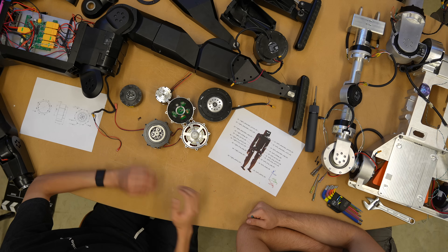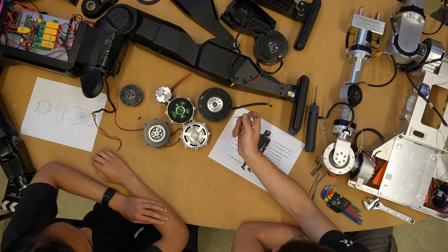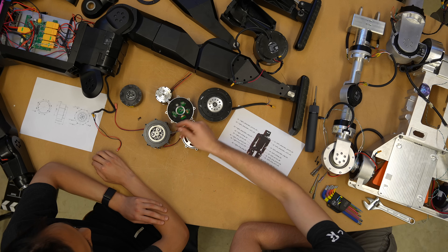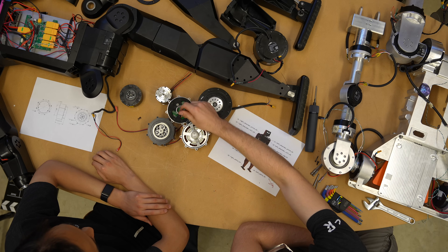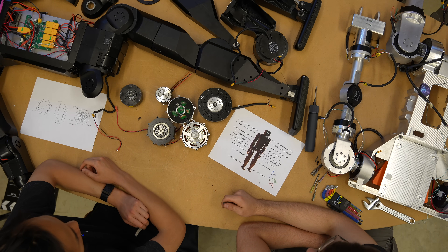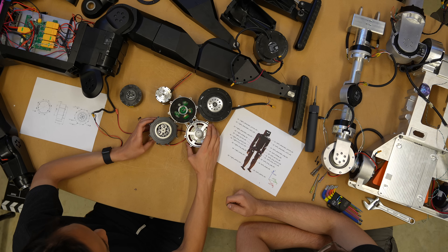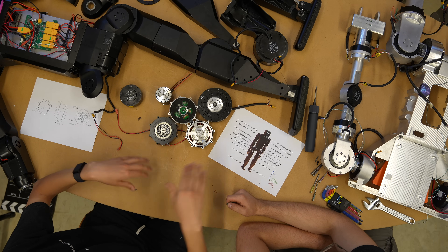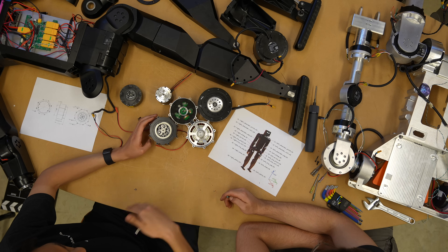The key elements of the actuator: you're seeing the rotor and stator — the outer housing for the stator and the rotor in the center. Specifically with QDDs, you see a high air-gap diameter, which gives you higher torque even for a lower gearbox ratio. Towards the front is the planetary gearbox — single stage within that 10 to 1 or lower ratio. Out the back is the actual control scheme with the PCB and a dual encoder setup. The dual encoders are important to give absolute positions. QDD actuators have been around for quite a bit — they start with the MIT Cheetah. Having a low gear ratio is really important because walking constantly changes directions; a low gear ratio means low reflected inertia, so we don't have to spend as much energy changing the direction of the actuator.